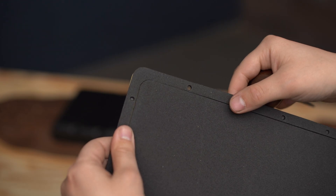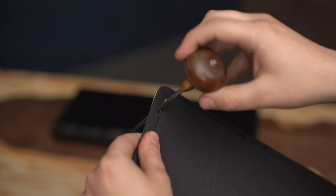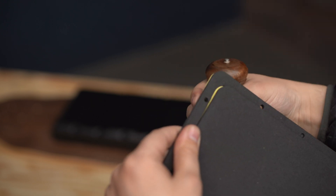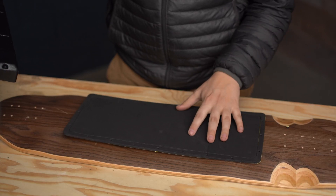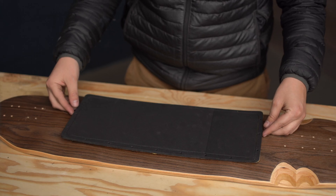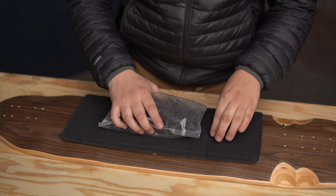The gasket included with your enclosure is used as a seal to make your enclosure more watertight, but it's also used as a template so you know exactly where to drill your holes. First, grab your gasket and push out all the little screw hole fillers — just poke them out, they're only there during manufacturing to keep everything in one sheet. Punch all those out revealing the screw holes, then lay the gasket exactly where you want your enclosure to be on your deck.